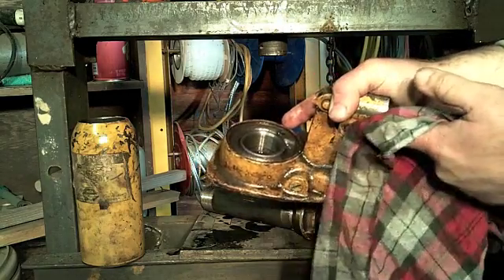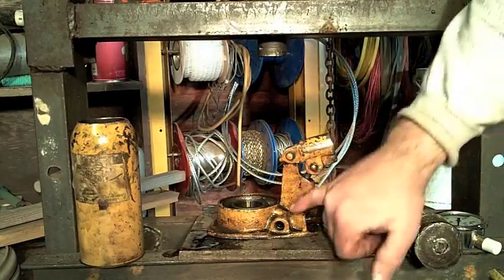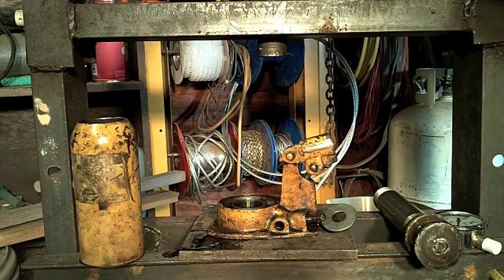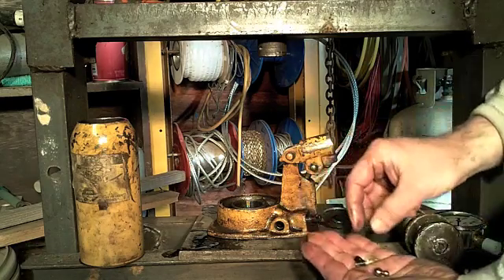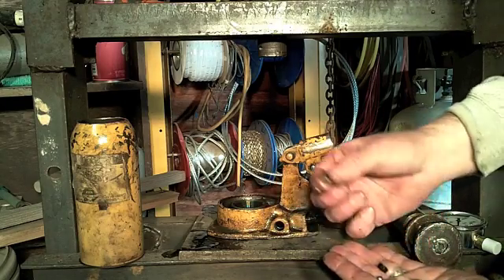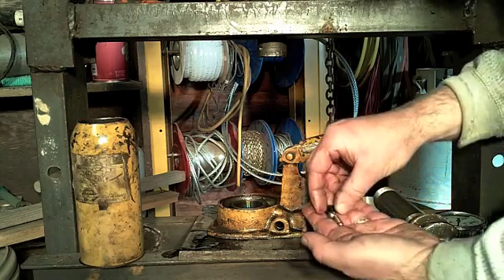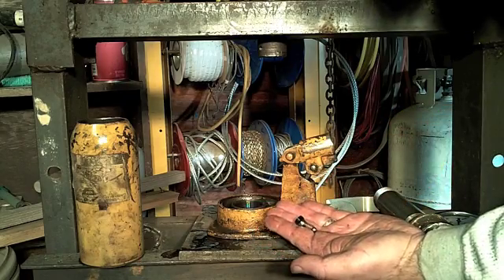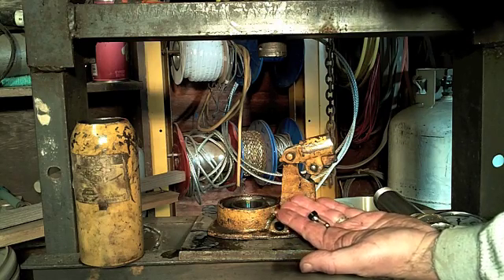We have to pull the ball return and pull the pump assembly out, and get ready to do some drilling down in there. Now I've got all the check and ball return valves pulled out. These are different for every jack, and you've just got to be careful and try to catch what can come flying out of the hole if you're not careful. A lot of modern jacks will have them behind the bleed valve. This one had them in the pocket — a small valve, basically a steel ball in a seat, with a spring on top of that, then the large ball, and then a rubber cup. They all go together inside something like this. If you shoot it across the shop and hear the little bits and pieces fall behind the corners, you're going to have to buy a new jack. So be careful.